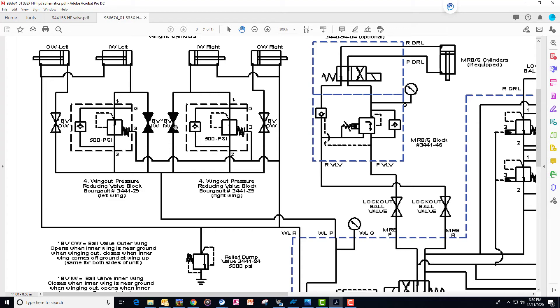On the inner wing, when the ball valve closes, it forces the oil through a pressure reduction valve manually adjusted to approximately 500 psi. That limits the pressure to the base end of this cylinder to prevent it from being bent. There is a one-way check in this pressure reduction valve setup — all that is there for is when we want to wing up the drill. The ball valves do not come into play when winging up. Even though the inner wing ball valve is closed, both wings can still fold. Naturally, the outer wing is smaller and lighter so it folds first, and then the inner wing follows. The inner wing oil from the base end simply passes through the one-way check and back to return.